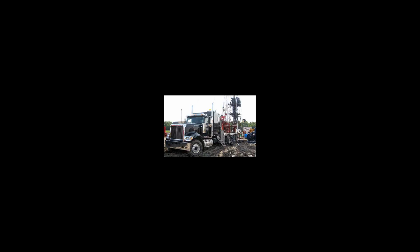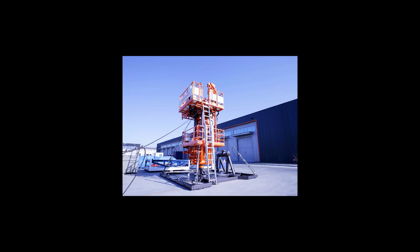Heavy pipe and light pipe. Because snubbing is normally done under pressure, initially, the weight of pipe in wellbore is less than the force due to the wellbore pressure. This is described as light pipe. Downward force is required on the pipe to force it in against resistance.